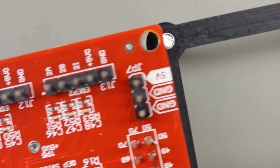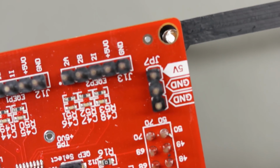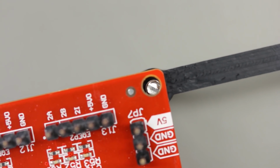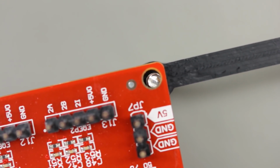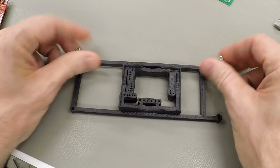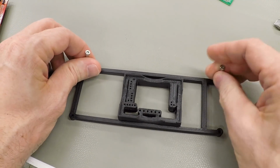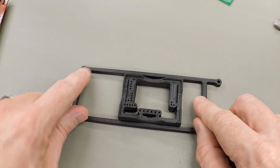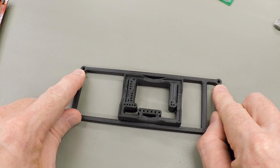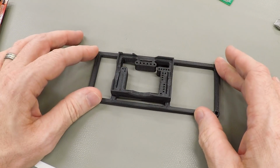And as you can see, I can get this centered in the camera frame for you, the screws do not line up. You can see that the screw's there, but the part is actually just a little bit too short. That looks to me, to my calibrated eyeball, like maybe about half a millimeter. So the part overall is actually too short by about half a millimeter. And that's not a matter of just extra material squeezing out the sides from over extrusion or under extrusion, because that would be around the entire perimeter of the hole. So the actual location of the hole is off. The holes are too close together. The part is actually too small.